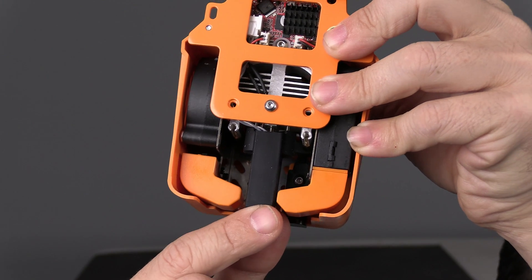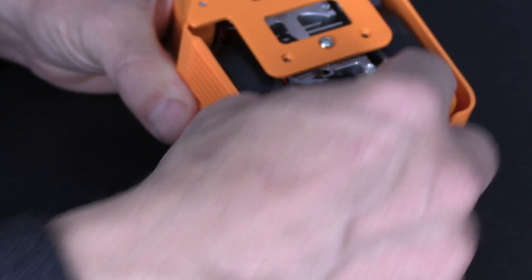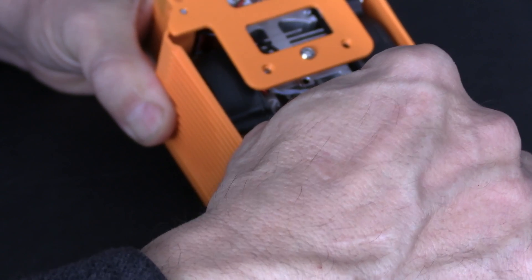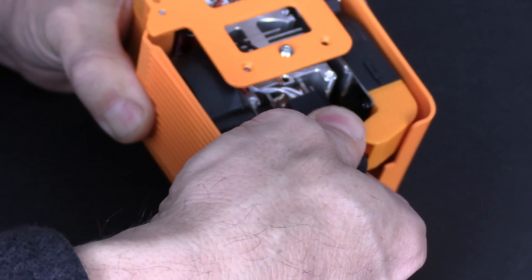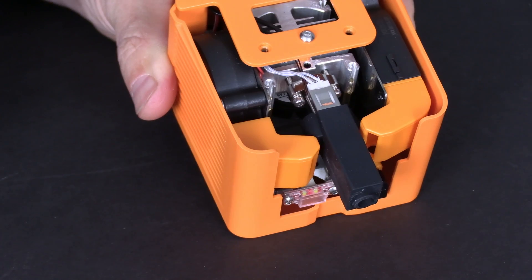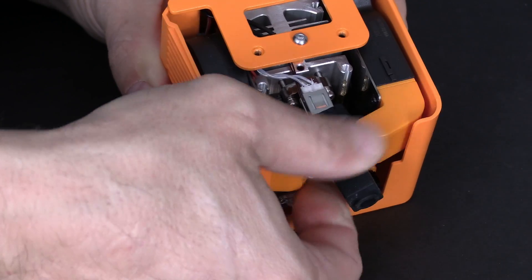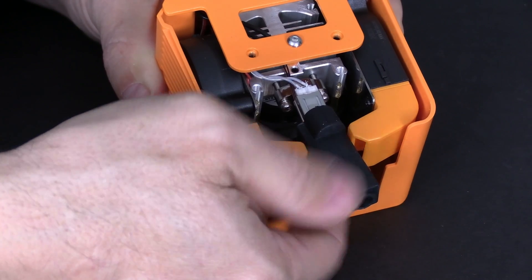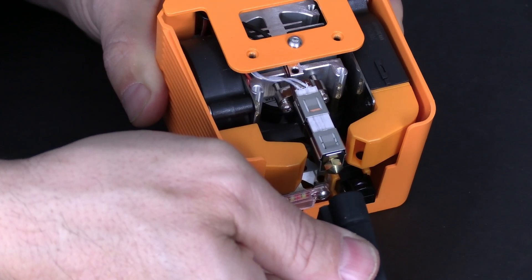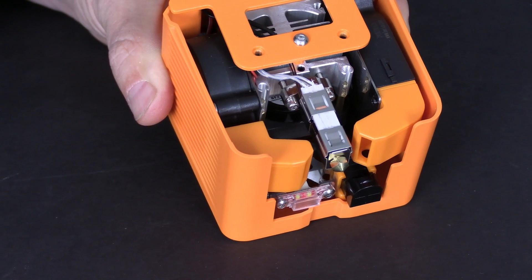The movement on this nozzle is affecting everything. In order to tighten this, you will need to remove the silicone boot. Use your fingers to work that silicone boot down. Once you get it mostly down, twist the silicone boot so that the lump faces the top, and remove it the rest of the way. This will expose the two screws you need to adjust.